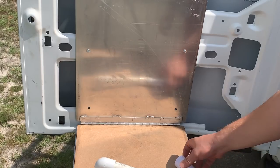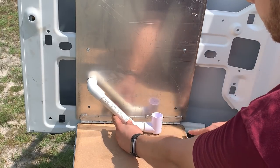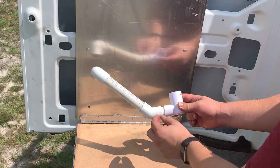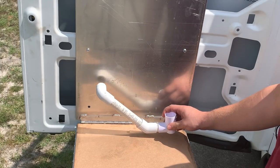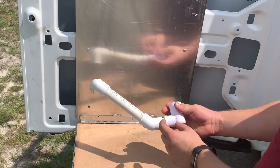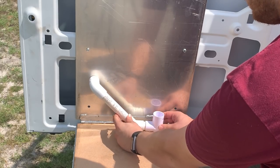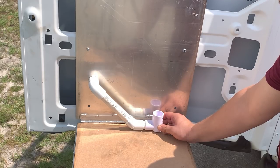Real quick, I want to add a little bit of clarification on the video. It was very much extended. The reason for that is we were doing the best that we could with what we had. The technician before us had glued the reservoir on the SS2 to the male adapter going into the secondary drain port. We didn't want to take out a perfectly good brand new SS2 and replace it, so we did a threaded coupling — we stubbed out of the 45 and then added a threaded coupling and attached our SS2. Ideally, we wouldn't want to do that because the longer the PVC pipe we run, the longer it's going to take to fill up the reservoir in the secondary float switch.